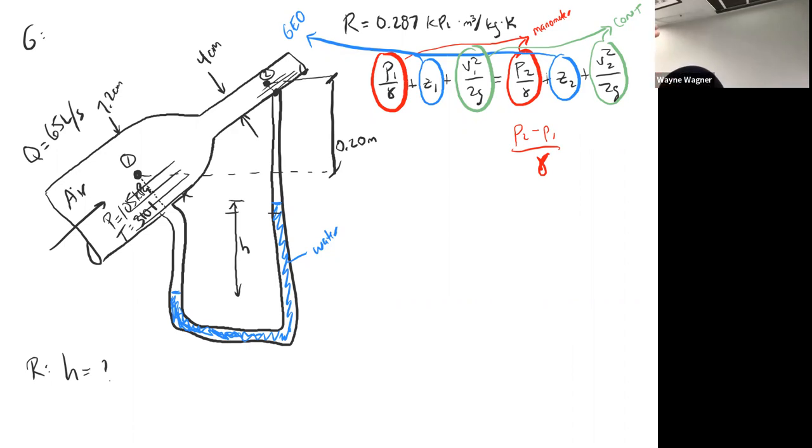maybe we should get the density of the air. Let's just knock out the density of the air. So in fluids class, if you have to use the ideal gas law, this is the one that we typically use. I don't particularly like doing the ideal gas law, but we use this one, where that R is gas specific. Okay. The R is gas specific. So we're used to, from high school or chemistry class, the ideal gas law where there's an R that is the universal gas constant. We just have a different one and we use this R that is specific. So I don't like it when it's just called R. I like it if it says R air or something along those lines so that we can keep things separate and moving. Okay. So anyway, let's go ahead and solve this.